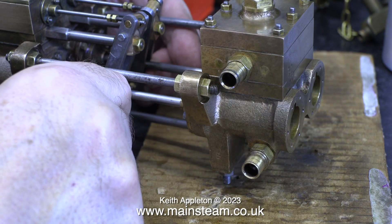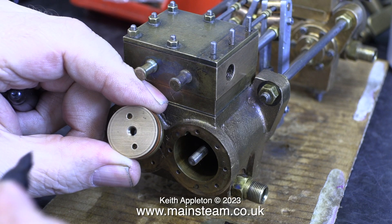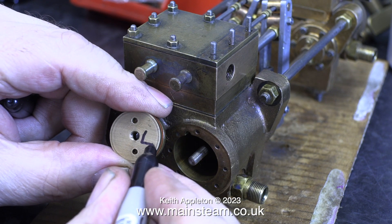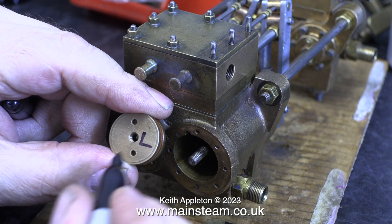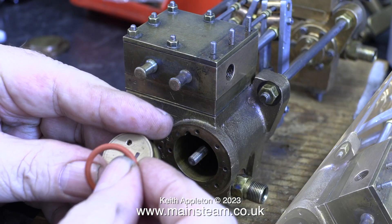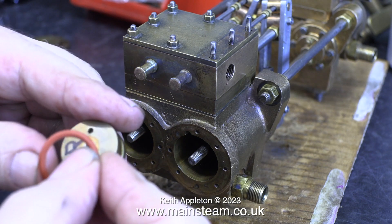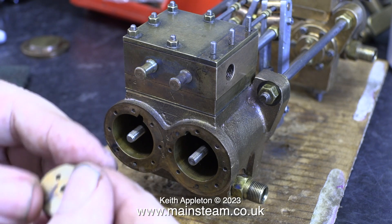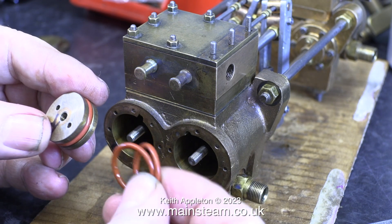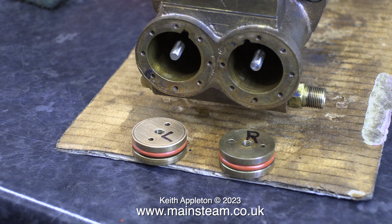Here, I've been having a bit of a fiddle with the fixing nuts. This design will only work with the pieces of bar threaded at the end with fixing nuts, adjusted to align the steam cylinder and the water cylinder perfectly. It shows me marking the left-hand piston with the letter L and then fitting the O-ring to it. Normally, when fitting new piston rings to a piston, whether they be cast iron or silicone, I would use some steam oil, but in this case I actually forgot — I applied it later. I'm not going to throw these old O-rings away, because they are in perfect condition. In the next episode, I need to separate the two halves of the pump.